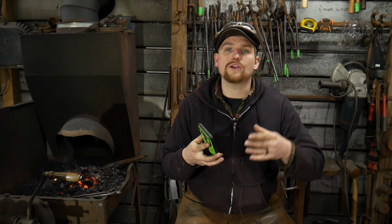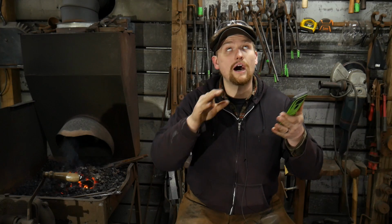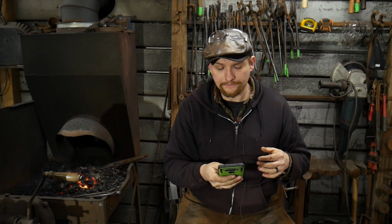You don't want a lot of dragon's breath coming out of the front of your forge. You want all of the oxygen and all of the fuel going into the forge to be consumed, so you won't have a big giant flame sticking out. When you have it adjusted right, it should be back within 3 to 4 inches of the front opening of the gas forge. That has been my observation for optimum propane usage, and to achieve a good welding heat you want an oxygen neutral environment.